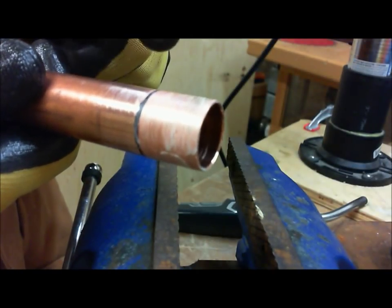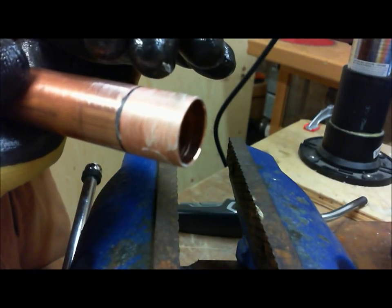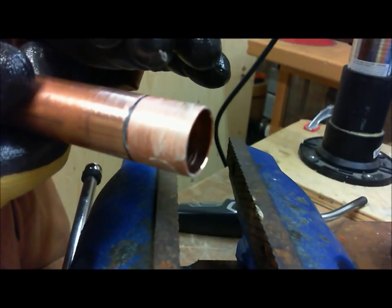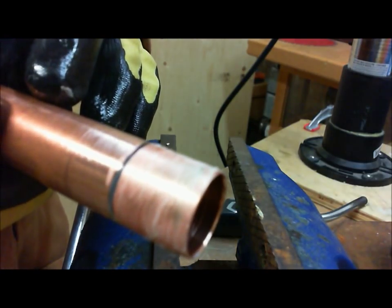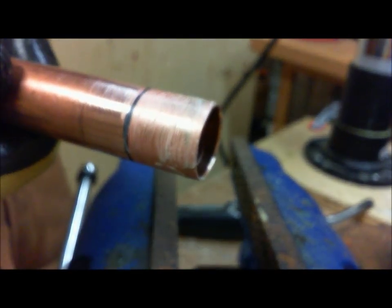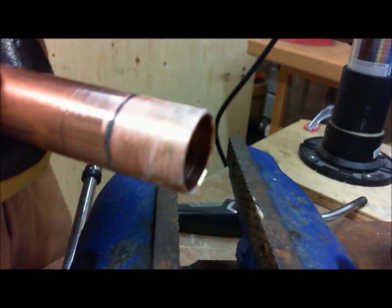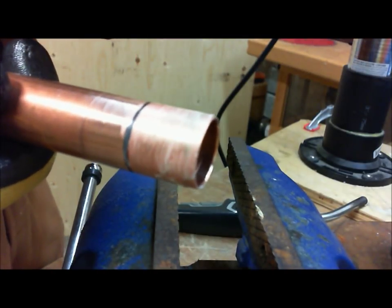I recommend that because it will begin to turn the pipe green, and that makes it harder to solder, okay? So right now it's a whitish translucent color. If it stays more than 30 minutes, you're going to begin to see it start turning green. So if you're going to do the soldering, make sure the soldering happens within 30 minutes.